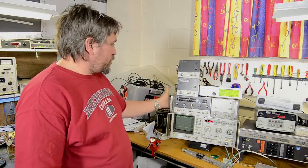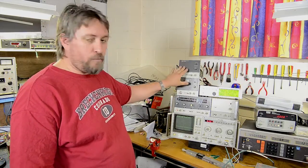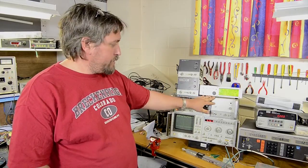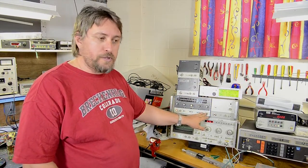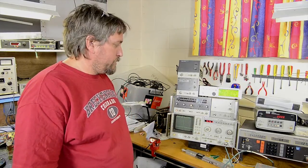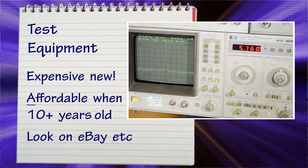Hi, G'day. I'm Peter, VK4EA. I'm just going to show you some of my test gear I brought down for the test and tune-up day. Here we've got a sweep oscillator — it's an old HP device but very stable, with plug-ins from 1.8 to 18 GHz. I use that for measuring return loss on antennas, feed horns and that sort of thing. And an old spectrum analyzer I picked up quite cheaply in the surplus market.